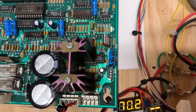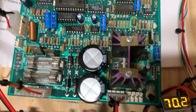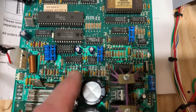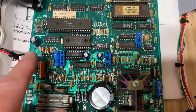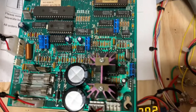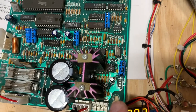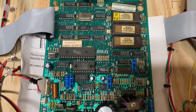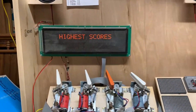While I had this board in the shop, I did replace the two input power filter caps, all of the 47 microfarad caps — one, two, three, four, five, six, seven — the 100 microfarad input power filter cap, and there's a 22 microfarad cap at this location that sometimes causes the amp to overdrive. That's it for the sound board.